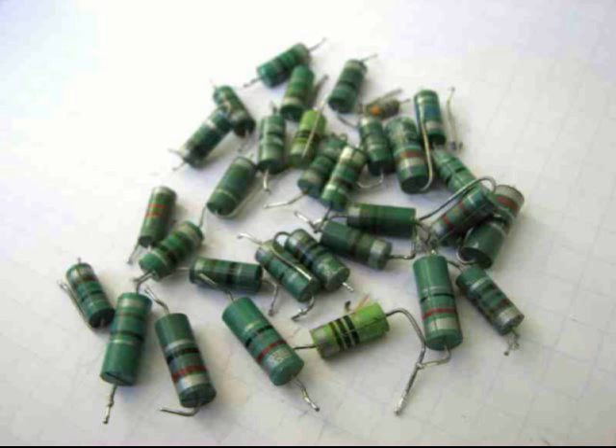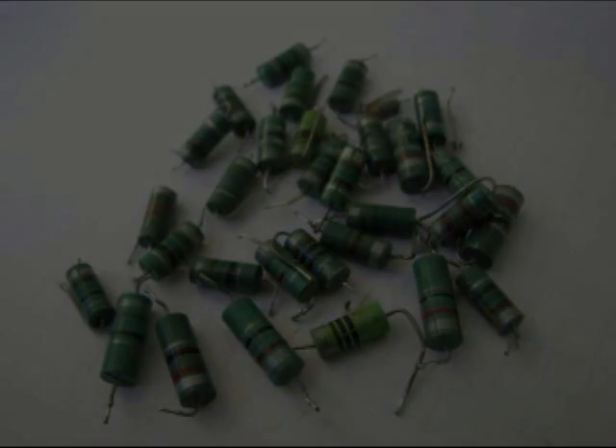Another nice feature of a lot of the VHF carcasses is that they've got a lot of these axial lead wire-wound inductors that are worth taking out. The inductances range anywhere from a few microhenries out to maybe 10 or 15, but a lot of them are nice values for circuit design applications down at HF, separate from what they were intended for — probably just power supply chokes for gain stages in the VHF rigs. These things tend to be pretty pricey when new; it's not uncommon to spend over a dollar apiece for a decent molded axial inductor.